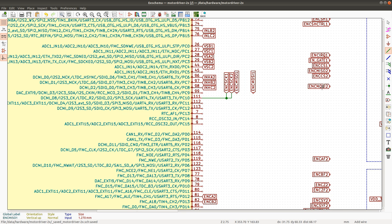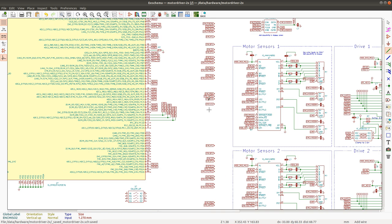So instead of calling this something like SPI 1 or 2 and then having to change that when changing the SPI port, I just call them by the signal names to which they connect, and then I connect multiple signals together like this. And MOSI is gonna go here. And they will connect right here. Okay, the chip selects are not critical, they can go to any GPIO.